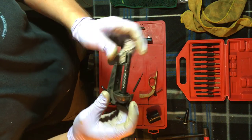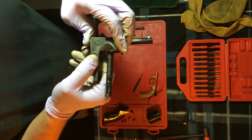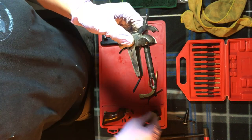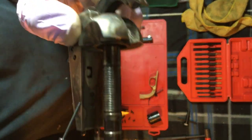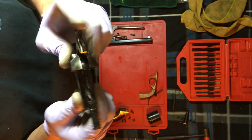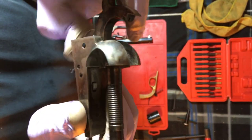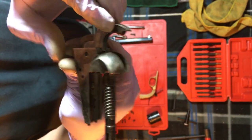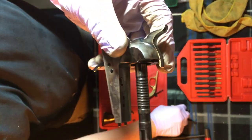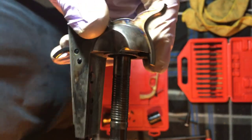I have my frame together. Now to make sure it actually works, I'm going to pull back on the hammer. Make sure the bolt — if you can actually see it — drops down to signify that it's in half cock. And when it's in full cock, it should go back up, which it does. And then in order to disengage that, you just merely pull the trigger, push the hammer forward, and it should fall. The bolt should remain in the up position for that.